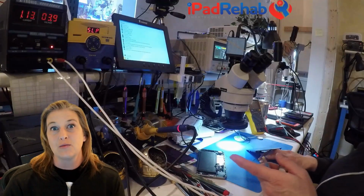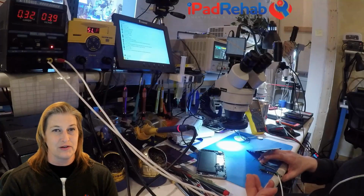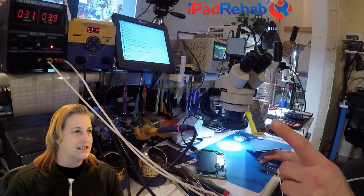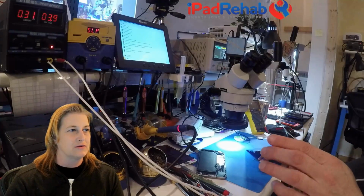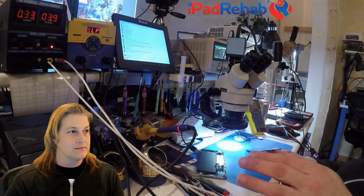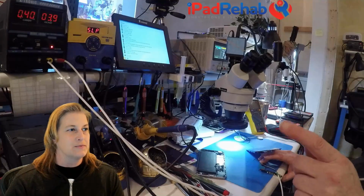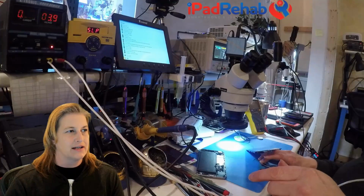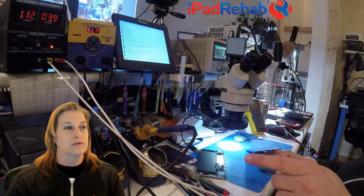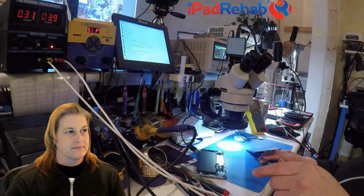All right, so given that we know this phone is not able to detect iTunes, even though it has a really normal looking DC power supply consumption, looks like it's normal booting, let's really study it and see if we can figure out in what way you are abnormal. So it looks fairly normal. It's hanging around in the 0.3s and it spikes up to 1 and then it seems to come back to this 0.3. Spiking up to 1, coming back to 0.3.